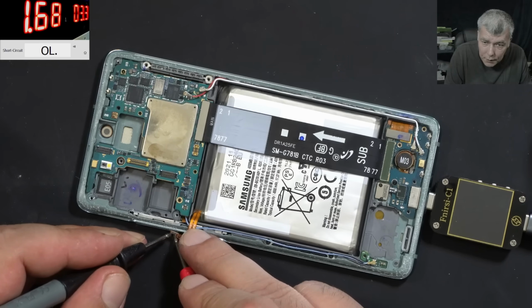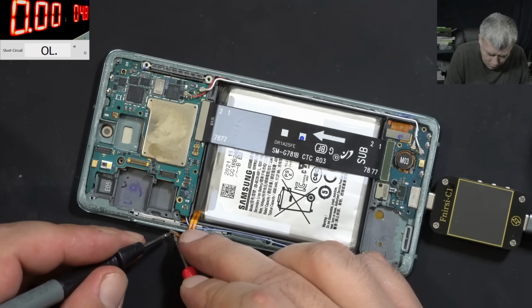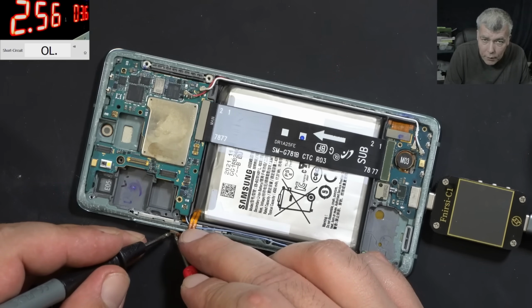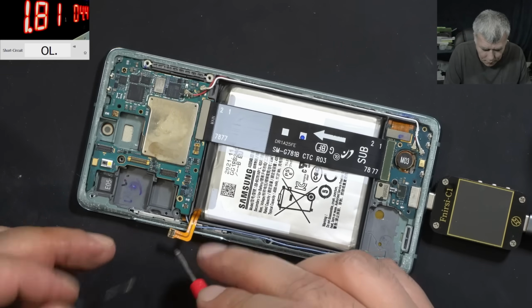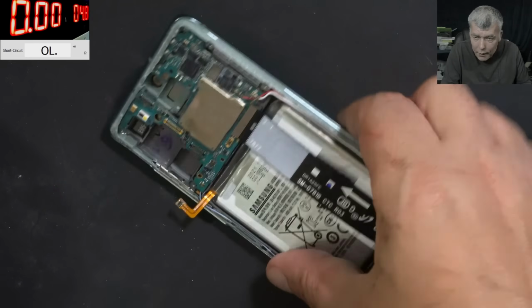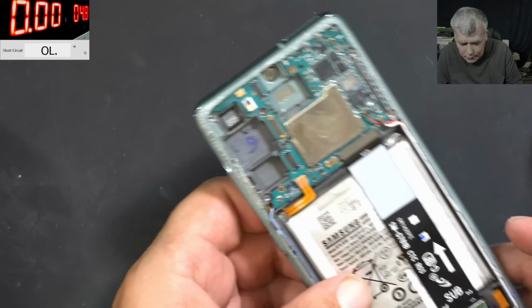The voltage is rising on the battery. More current. Good. And we are pushing 2.5 amps, and it's fine. The voltage is 3.6. Yeah, and it's going up 3.7. Yeah, the battery is very discharged, and that's expected. Good. That's not a problem. The problem is why the meter is not coming on. Plug in the battery.